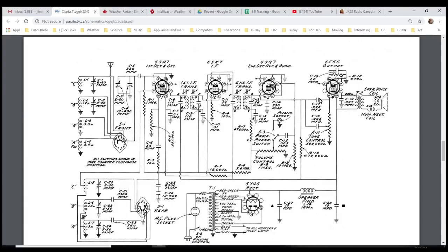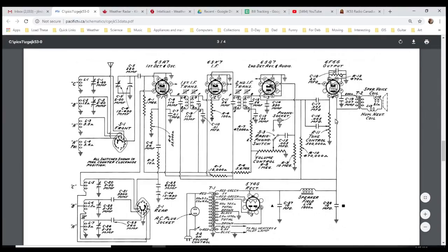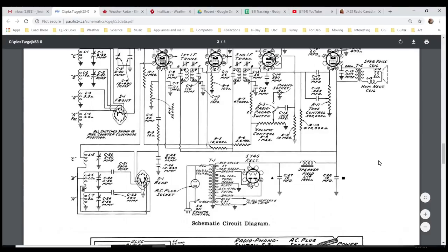What if these coupling capacitors are a little leaky? There's 250 volts pushing on this capacitor, potentially pushing onto this grid. The grid is high impedance, so just a little bit of leakage will throw off the grid voltage and raise it positive — that's the silent killer of these tubes. We've reached the end of the road. We have a signal coming out of the plate, and to change the impedance we use a transformer — dropping down to around 3.1 ohms — and the speaker works.